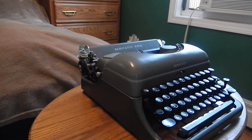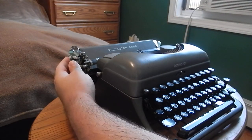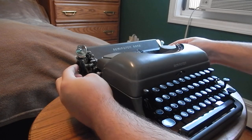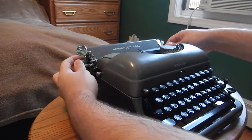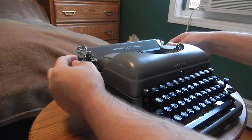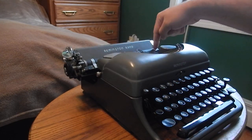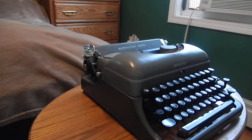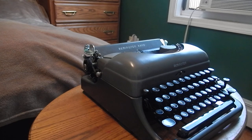Basically like most of these Remington portables of this type with the geared type bars, you've got a carriage release on either side. Behind the return lever you have a fine line adjustment which you can push in and turn, and it locks in place — pretty cool feature. This is your carriage lock here; you just pull it forward and it locks in and you push it over a tab that holds it in place. Your ribbon reversal here, paper fingers on either side, and a margin release button. This is my first Remington to have a keyboard margin release — on the other two I have, you have to reach behind the carriage and lift up on the margin bar to release the margin. This does have a tabulator.